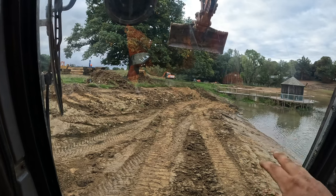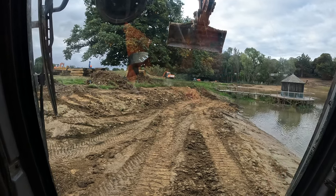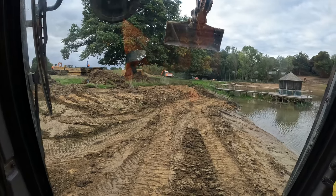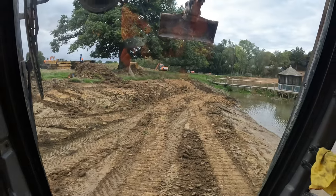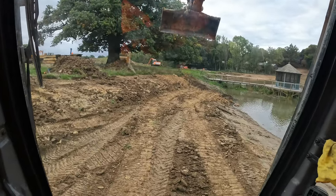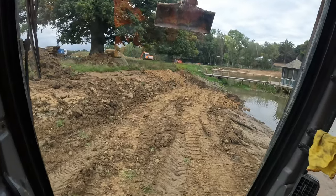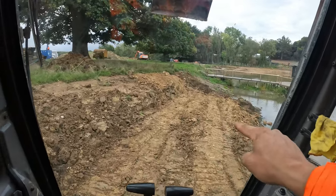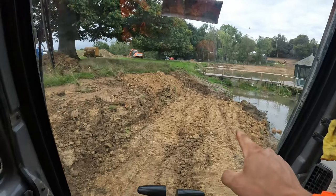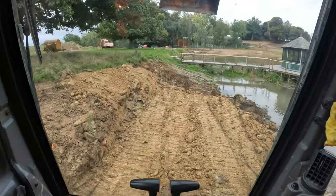The best would be if we have a wheel compactor, but we haven't. No drama. You can use the machine itself just to track it in. Put it in thin layers, track it in. So I'm doing that. And once I've done that, like you see it here, I get a bit closer and you will see it. So that's already filled material here. That's about, I think, two dumper loads here already. Tracked in a thin layer.